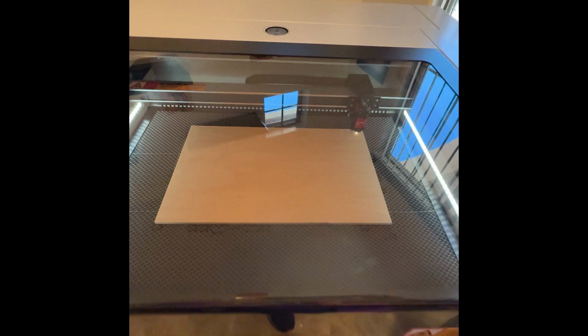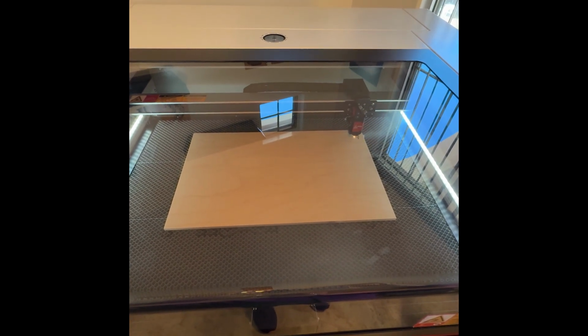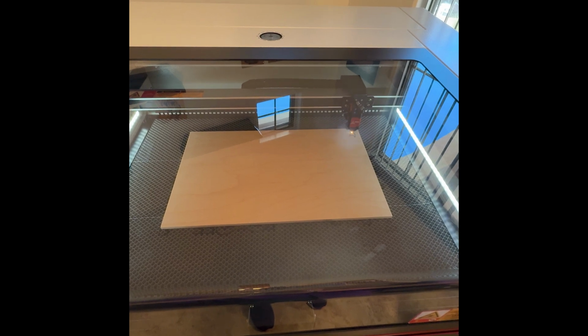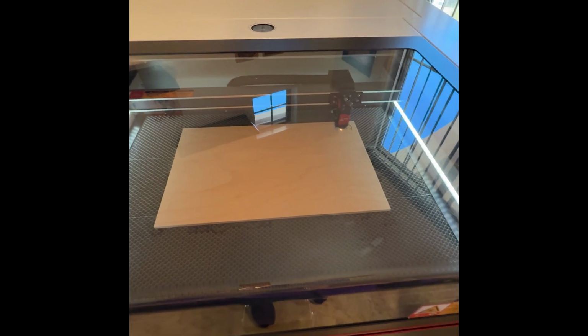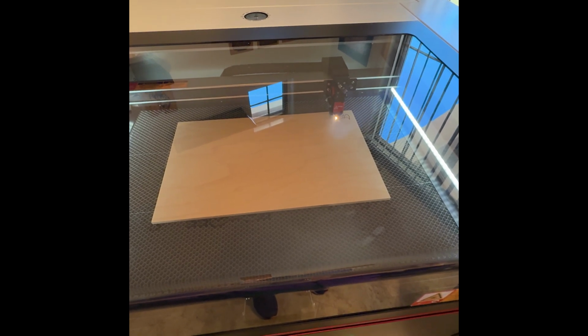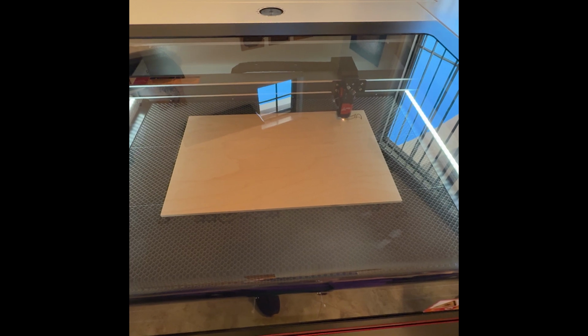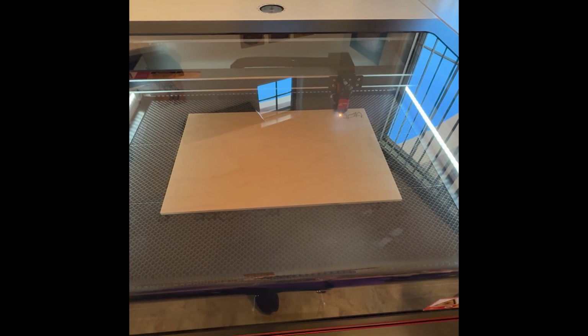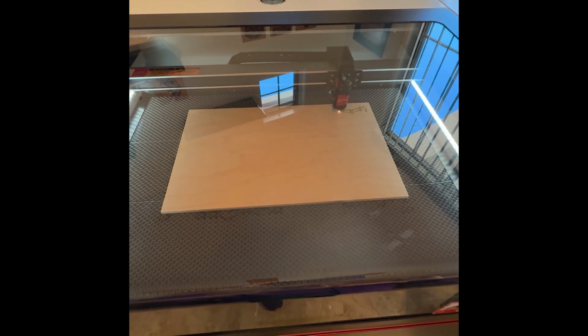And this thing, there you go, the actual sound. And look at this. This is 1/4 inch thick maple. It's from a source that tells me, like in my Glowforge, I needed to run it with 2 passes to get it to cut through well. I am running it on this laser, and I just did this yesterday actually for a whole other one that I wanted to test it out on while I was getting my settings right. And it cut through beautifully. I didn't have anything stay in that machine.